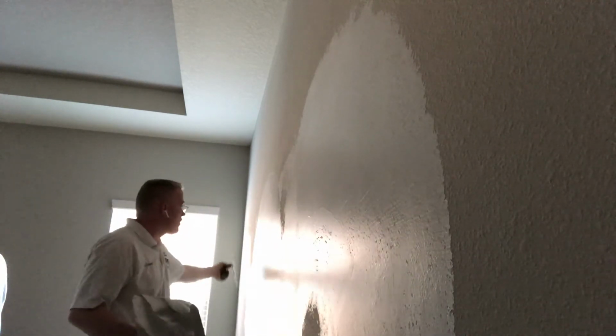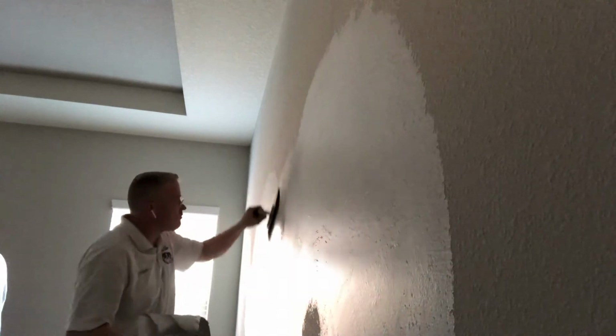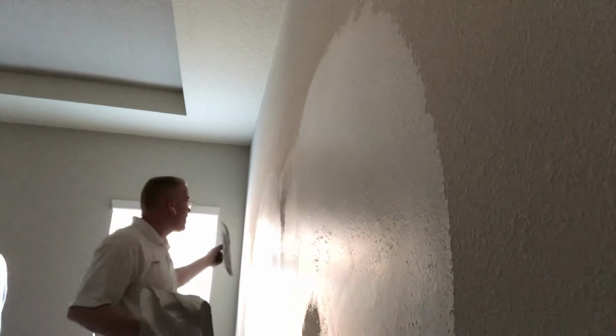When you want to knock down the lines that you've made, when you've done your rainbows, very important that you start off the surface of the plaster. Let's say I start on the surface. Let me show you what would happen. You'll understand more easily what I'm referring to. Okay, so this is smooth, right? Watch this. Look what I just did. Look at the mark I made on it.